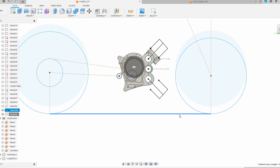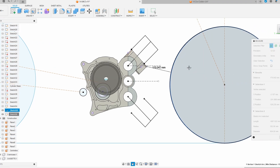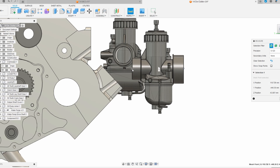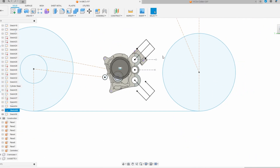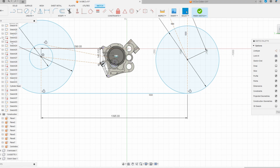There's no way we need that much travel — 218 mils is heaps. Say we can get the carb right in here at 170 mils. Now these random carbs I've borrowed — 100 mils, 70 mils to play with. Bear in mind 28mm flat slides are probably going to be shorter than that, so we've got room. That is 170 mils with an RGV length wheelbase. If we go to a GSXR or Yamaha R6 wheelbase it might even be 1415.